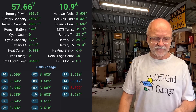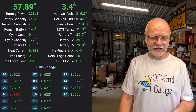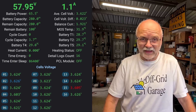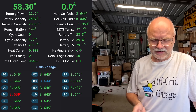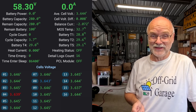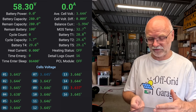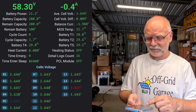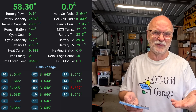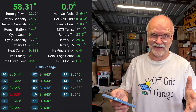At 58 volts I have set 10 amps going into the battery, with 20 millivolt deviation. After another 10 minutes we are at 58.3 volts - I've slowly increased the voltage. We are close to 3.65 volts on almost all cells. Cell number 15 is still a bit down and cell four is under 3.64 volts, but everything else is under 10 millivolts deviation. The balancer is still occasionally active but we're 100% fully charged and top balanced now. Let's fire up the Tesla.